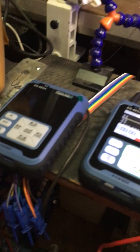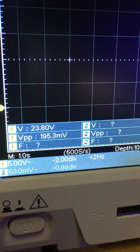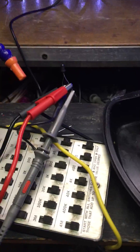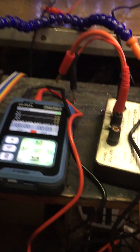This is about as low noise as I can get — I think this is like 30 millivolts of noise as I had it set. Right now it's about 190 millivolts but that's washed out by the signal itself. When you put high impedance on it, like if I put it on this resistor decade box — and notice I've got really short leads to try to minimize that noise — the higher the impedance, the more fluctuation you'll see.